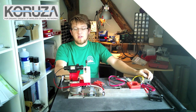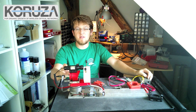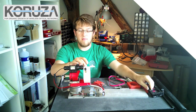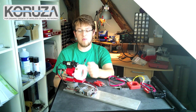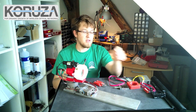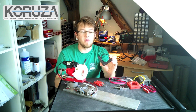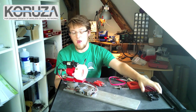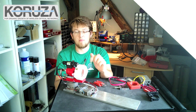The prototype is evolving and all the complicated, expensive pieces are being replaced with printable ones. You can see the piece that houses the lens with an alignment system that has previously been a standard lab equipment mirror mount, which is quite expensive. I have designed and built a 3D printed one using micrometer screws for precise alignment.